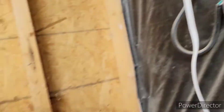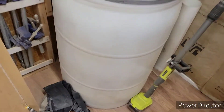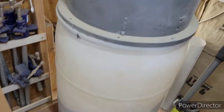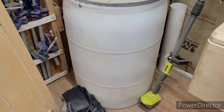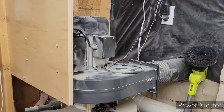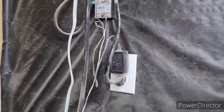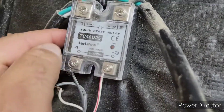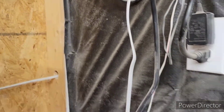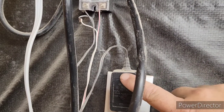Once I have power energized here, this will close the connection between the two terminals and I'll have power in my strip. The reason I used a strip is I've got the dust collector plugged in there, and I also have a light in the back — with the LED light you can see how much dust is in there. The white plug is the LED and the black plug is the motor. This particular relay operates on 3 to 32 volts DC.